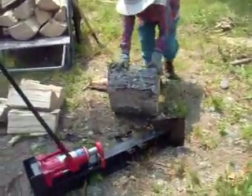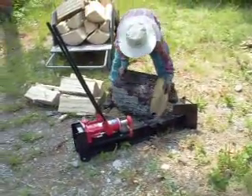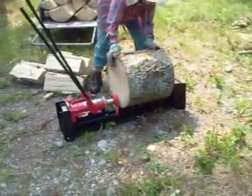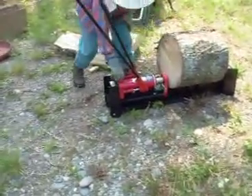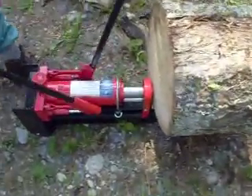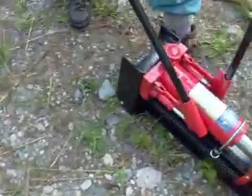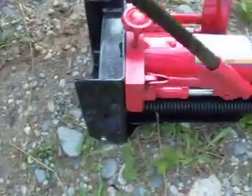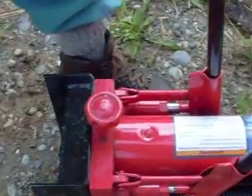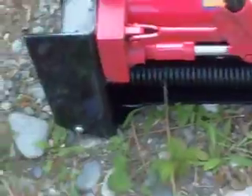Maria Udo is now going to demonstrate the use of our new manually operated hydraulic actuated log splitter, with a wedge to the viewer's right and a piston to push on the log to the viewer's left. The main force piston touches the log and receives hydraulic fluid from two smaller pistons. The one closer to us is smaller in diameter, while the one further away is for rapid advancement and this one is for small strokes but very great force.